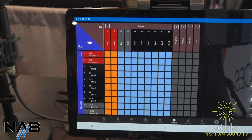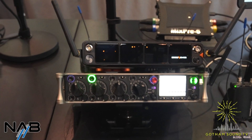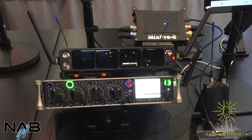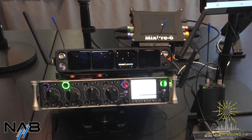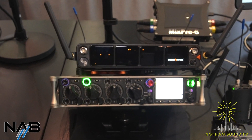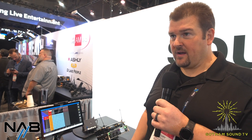Another thing often requested is a higher contrast screen. You can see on the 888 down here we've got it set into a daylight mode, which gives you higher contrast so if you're out in direct sunlight it should be very readable. We've gotten that request quite a bit. The last thing we're highlighting with version 10 is 32-bit float recording for your ISO tracks. The 24-bit option is still there, but if your preference is to record ISO tracks in 32-bit float, you can. It is just for ISOs — you're still going to have 24-bit mix tracks. Noise assist and auto mix are still happening downstream from the ISO capture, but you do have 32-bit float ISO capture if you want.